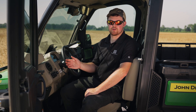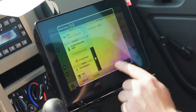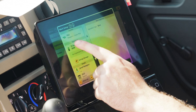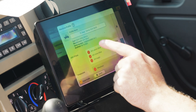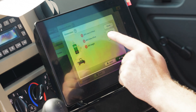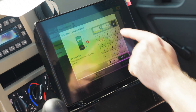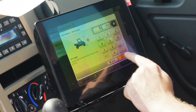Now that we have our measurements, we'll need to go in the screen. On a Gen 4 or Gen 5, go into Setup in the bottom left. If you don't have this button, go to Menu, Application, down, and Work Setup. Click on your piece of equipment and then click on it again. Here we see our GPS inline offset and GPS height. In our case, the receiver is dead in line, so we don't need to put a lateral offset. Here's our GPS inline offset from the back axle to the receiver — the center of it. Type it in, hit OK. And our GPS height — that's from the ground to the midline where the green meets the yellow. Hit OK.